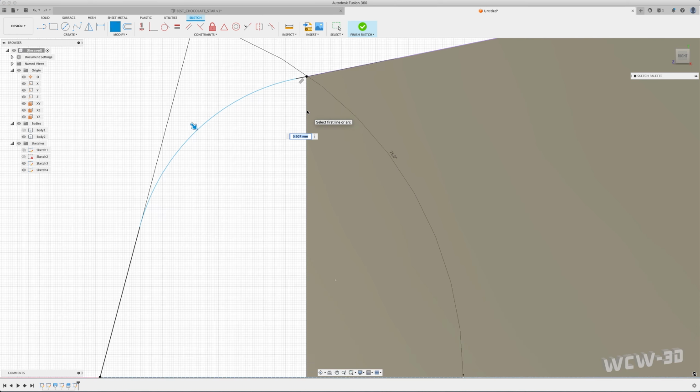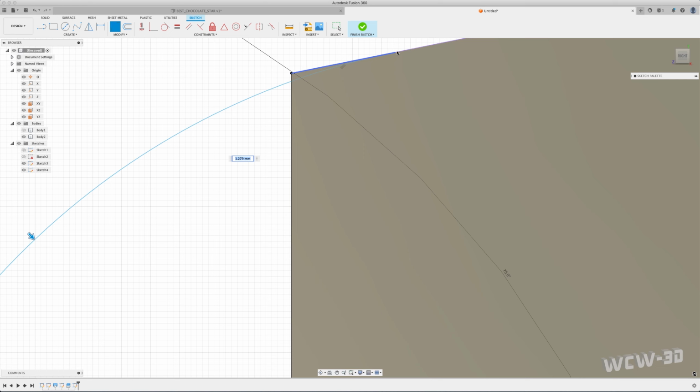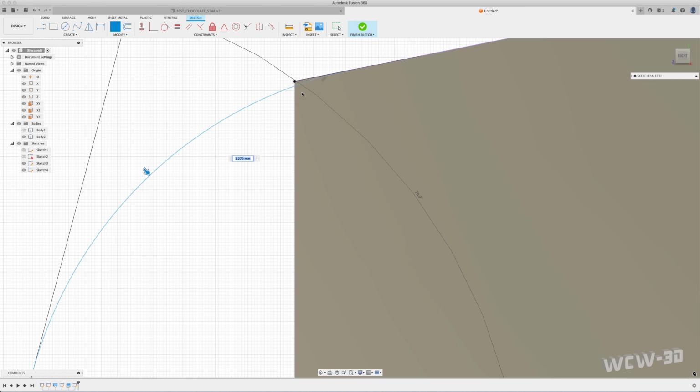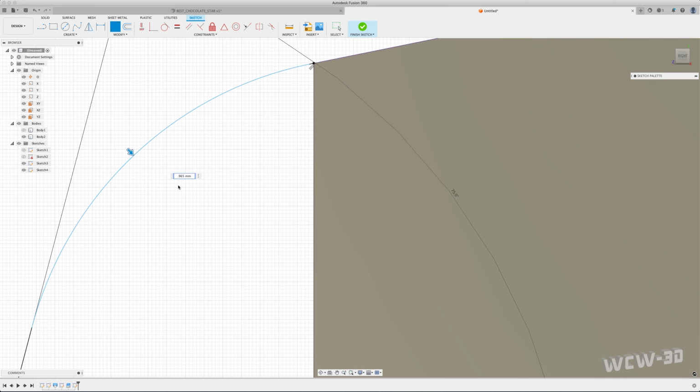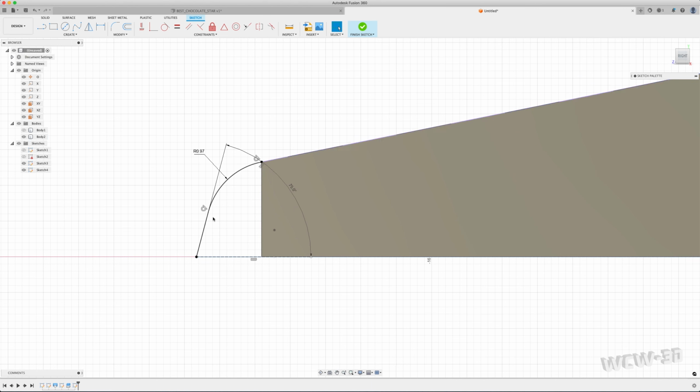I want to show you here. I'm creating this fillet that's a nice curve. If you go too far, you'll see it breaks the geometry. You won't get a smooth transition. You can't go past that line. I'll leave it right there, 0.965. I could probably even do 0.97, to try to keep it less. All right, we'll leave it right there. I feel like it's a nice transition.